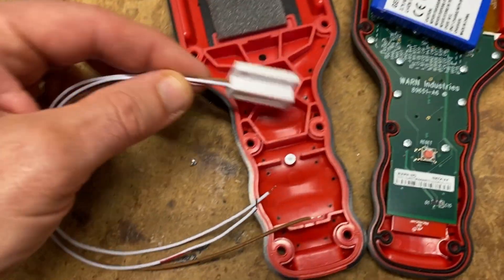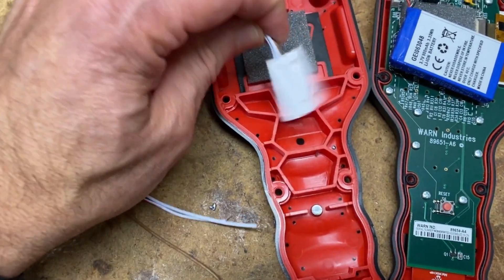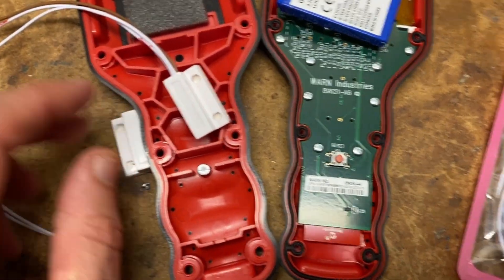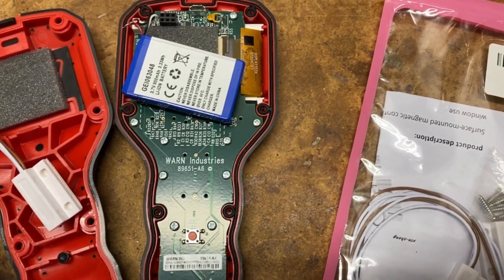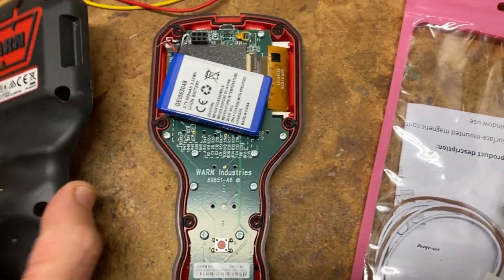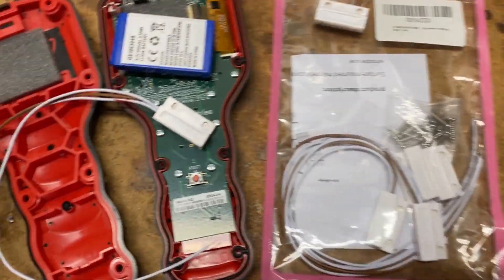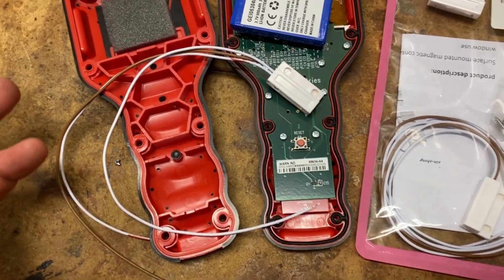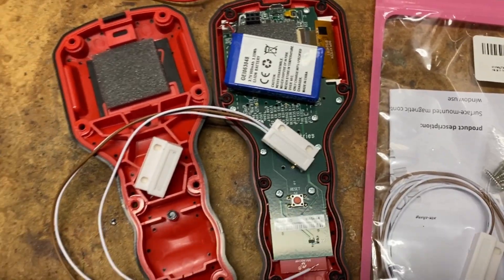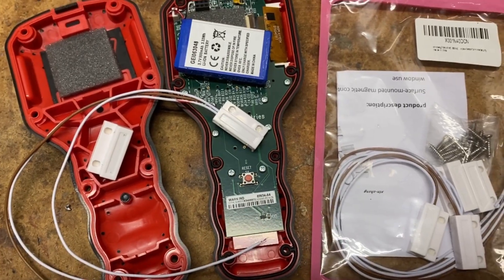The plan is to embed this magnetic reed switch into the handle — I'll do a little Dremel work and embed it so that when the magnet is not present outside the plastic, it maintains full connectivity and the remote works normally. Then all I have to do is store the unit with the magnet sitting on the handle; the reed switch will open up and disconnect the battery. The advantage is I don't need the magnet to make it work — without it, it functions like normal. Placing the magnet against the handle instantly turns it off.